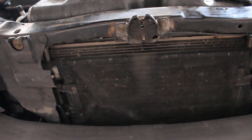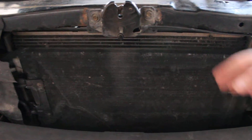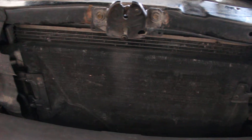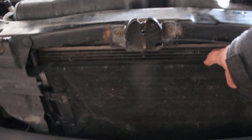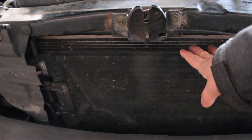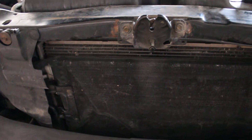Then it makes that circuit all the way back through the radiator again. Something some of you may have seen — certainly in heavy trucks and agricultural equipment like tractors — is that when it's really cold, people will stuff a sheet of cardboard or plywood in to block the radiator. That might sound like a dumb idea, but in very cold winter conditions the radiator can actually cool the coolant too much, so you block part or all of it to reduce the cold airflow over the radiator.